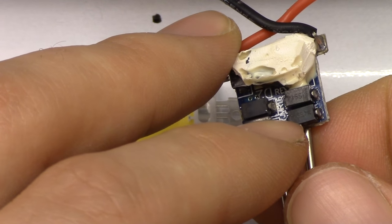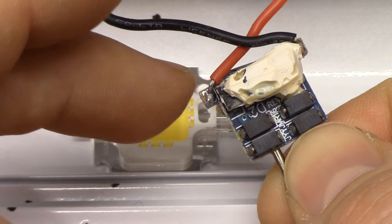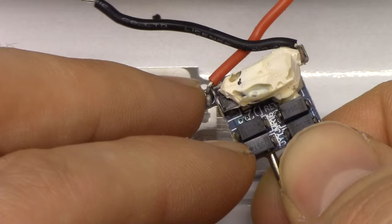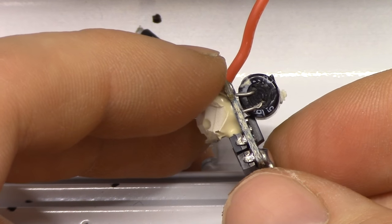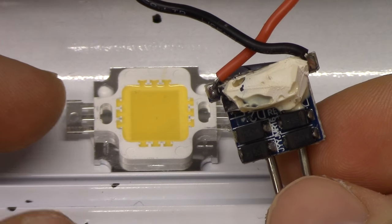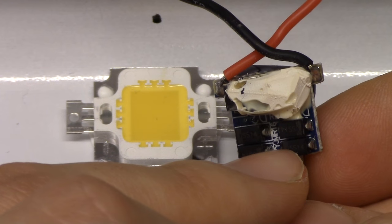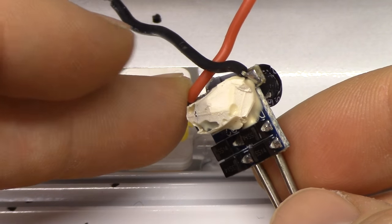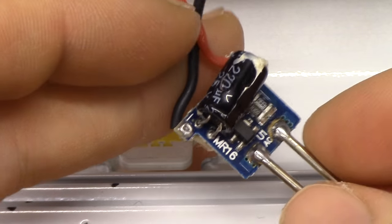Since I'm not interested in running these off of AC, I'm just going to remove these diodes. When running off of 12 volts, the voltage drop is so high on these that most of the power dissipation is in the actual diodes. I gained roughly 10% efficiency by simply connecting across the input capacitor, rather than into the diode bridge. That's because these LEDs have a forward drop of about 10 volts, and at 12 volts you just have about 2 volts to play with. These Schottky diodes drop the voltage to about 0.4 volts, basically forcing the regulator to go into 100% duty cycle mode. But removing the diodes allows them to run perfectly fine off of 12 volts.